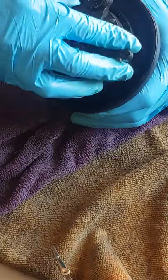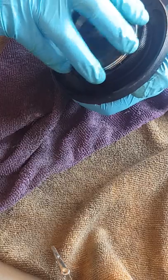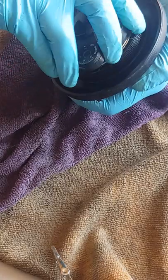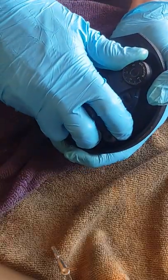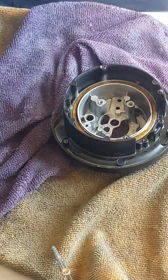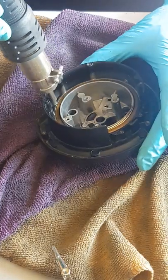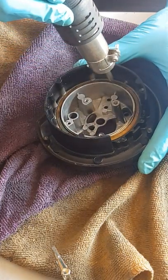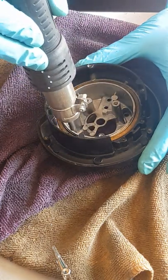What I'm going to do now is screw it back in there. Doesn't matter about calibrating it or lining it up where it should be — just get it so it screws on. And now I'm going to go clockwise; as I go clockwise it should free that other ring off. Might need heating up again — as it's cooled down the grease has got thick again. I'll heat that thing up — don't have to put a lot of heat in, just enough to free the grease off.